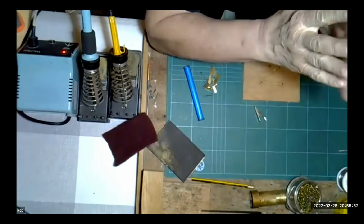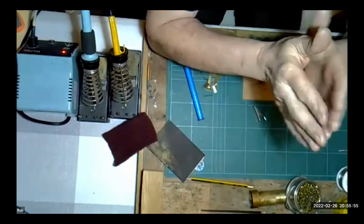They're both soldering connections, but they are different methods of achieving a solder joint. Certainly for electrical soldering, you apply the heat to the joint and add the solder. If you're doing effectively sheet metal work with brass or nickel silver, you're using a separate flux and a separate solder which doesn't contain flux, and you can then transport the solder to the joint on the iron. But it won't work if you're using rosin cored solder. Okay? Is that all right, Dave? Yeah, thumbs up from Dave.